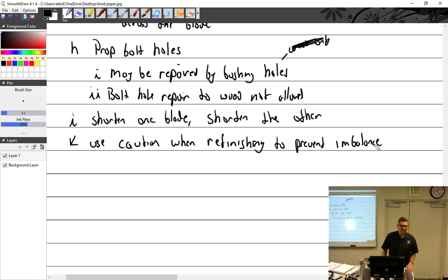Back when I was at JEDEX doing it, I'm like, man, what are we going to do? I'm like, well, just pull out the manual. Give me the data, and they bring me the data. I'm like, all right, this is what we've got to do. In repair, this is my width, this is that. I used a rubber abrasive disc, and you just make all your marks, know what you're going to do, measure it out, go in there, polish it till it's done, Alodine it, paint it. Call it a day. No, not a big deal. All right.